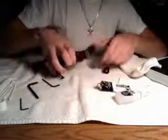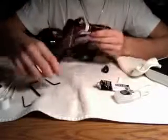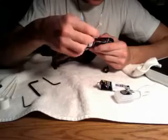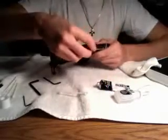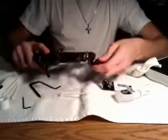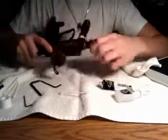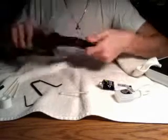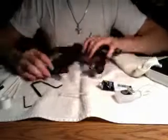Take this. And then again, there's another O-ring inside of here. You can't see it in here, but you're just going to want to clean that with the Q-tip. Put the oil back in there again. And you're ready to put this piece back on, your low pressure regulator back together. And then the last thing you want to do is right here.